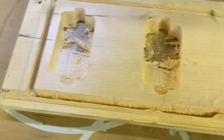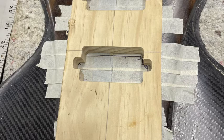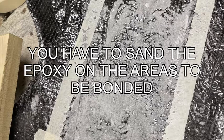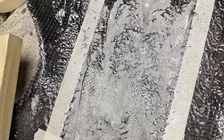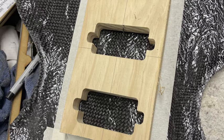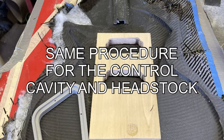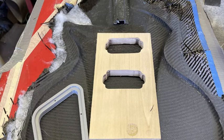This is just pine, so it's extremely light and strong enough to hold the screws. The trial here is to make sure everything's intact — you only get one shot at cutting this and you really don't want to make a mess of it. Make sure you sand the epoxy; I usually use about 120 grit just so it holds. You really need that for a mechanical bond. I'm laying it all out just to keep glue marks out, using tape around the edges. I use a lot of good gel epoxy and glue all these areas in place.